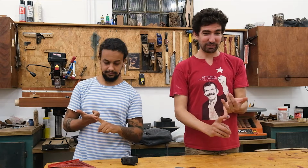All right, so glue up's done. We've got our headboard assemblies glued up with the rattan covered panels, looking pretty sweet. We have our footboard assemblies glued up, and we have our floating tenons pre-glued into the long side pieces, or whatever they're called, so that when we do final assembly in place in the jungle, we will have less gluing to worry about. And now we are going to work on the substructure of the bed, which is what the mattress will sit on. So we're going to rip down some stock, and Nabil is going to get to gluing and screwing some scrap mahogany to the inside for the slats to sit on, and I am going to get on milling down a little bit of trim for the rattan. All right, let's get to it.